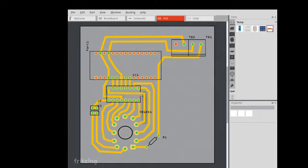So because I just wanted to build this as a testing circuit, I included these jumper wires. So this one line, which is coming out of pin 9 on the IC, can be connected to either this line or this line. Turns out that this is digit 1, you can see that here, and this actually says no connection, but this is actually a little decimal point. So in this particular circuit, you can either choose to put on the decimal point or put on 1.